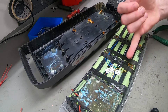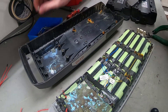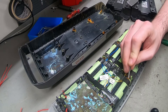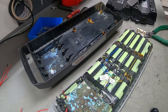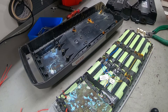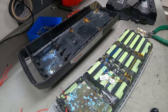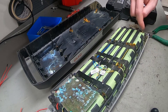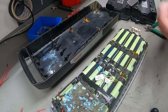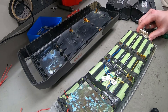Here you can see they're using wires. I've repaired a couple of them — they're complicated. The screws go just beneath the cells, so you have to align it perfectly and use the original holders. They have pretty good snapping plastic, and they twist the battery pack like this. They use what I call the Promovec config, because Promovec was first with this layout. They've added these two cell groups together and these two cell groups together. It's one of very few actual designs — you can have it with 40 cells.